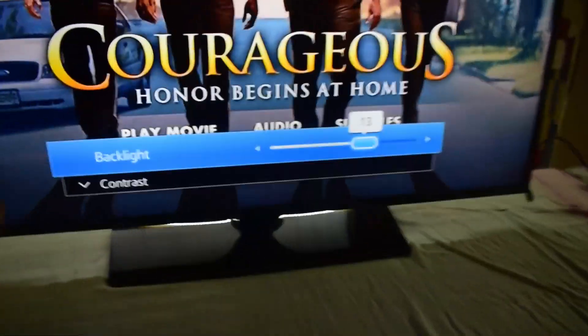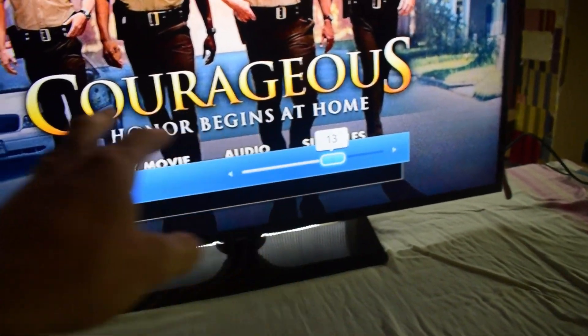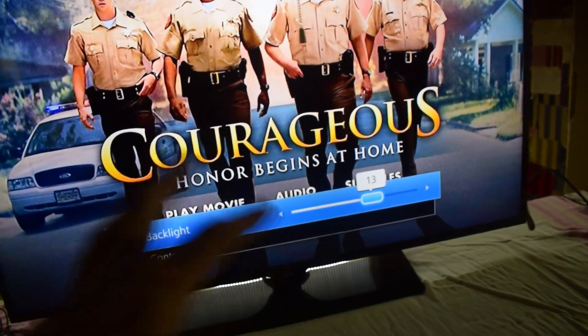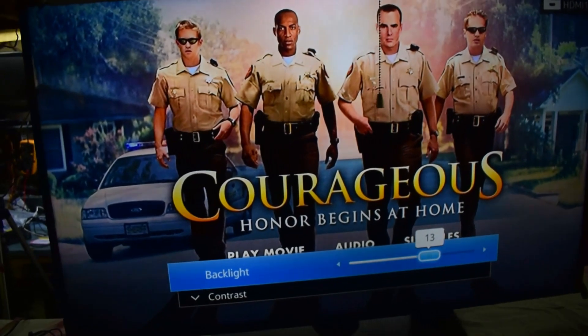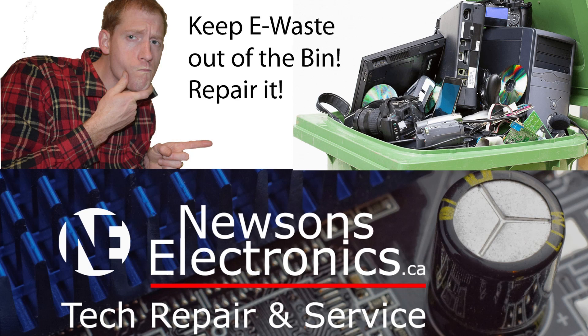There it's working. Now just make sure you go into settings and you change your backlight. This was set to 20, which is like maximum backlight, and that will destroy your LEDs over time. So just turn that down a little bit and it should save the TV for many more years. Thanks for watching. If you enjoy electronics or want to learn about how to fix electronics, consider subscribing and I'll see you in the next video.